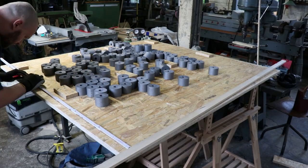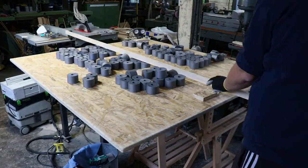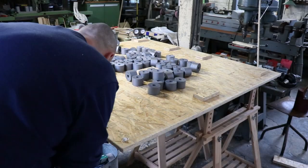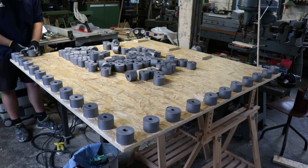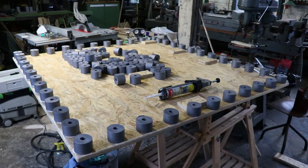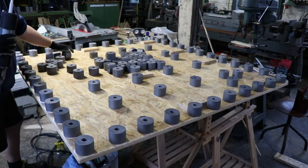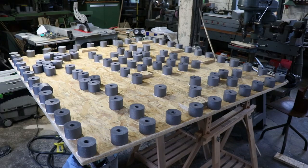Next I drew a grid on the bottom side of the podium so that the insulation pieces looked tidy on the board. I opted for 11 bases on the long sides and 10 bases on the shorter sides. I used the assembly adhesive to attach them to the plate and spread them on the podium. I placed most of the bases in the middle of the board, as this is the place I was going to sit the most on and where the most weight of the drumset would be.